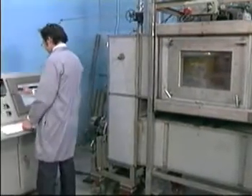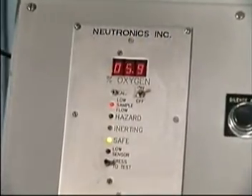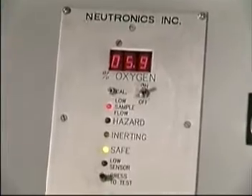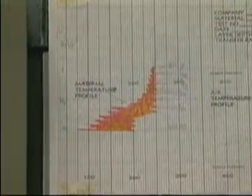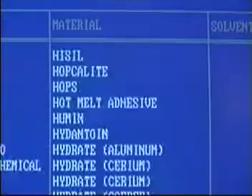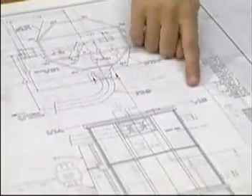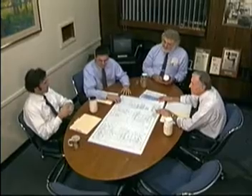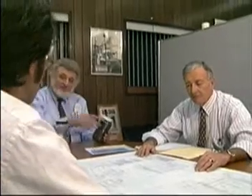The drying medium can be either air, conditioned air, inert gas, or superheated solvent vapor. All results are tabulated and graphs of drying curves are prepared for use by the engineering department. No two projects are alike. Every drying problem presents a challenge to the engineer's resourcefulness. Training, knowledge, and imagination are all equally necessary in working out the right answer.